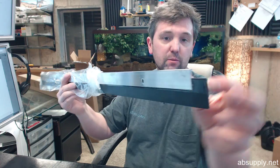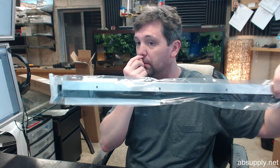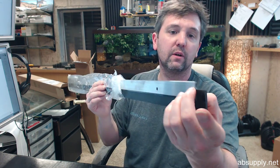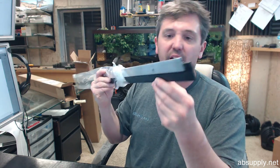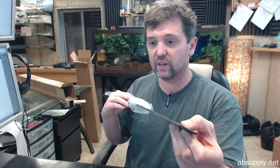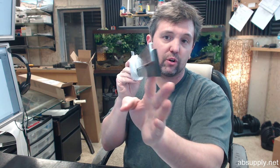You've got an aluminum holder here with a solid piece of neoprene in the back. It's typical and common for it to run long from the factory on both ends — it's for you to trim exactly. This client specifically asked for it to run about a half inch longer than standard. Solid neoprene is going to smell like car rubber tire rather than being a closed cell, so it's quite durable, maybe even rigid, less than pliable. You're going to want to make sure that the approach to the threshold does not require an extreme amount of bending. You don't want a lot of compression to be asked of this door sweep by your door closer.